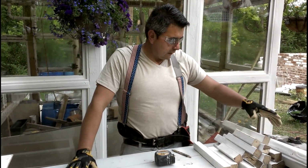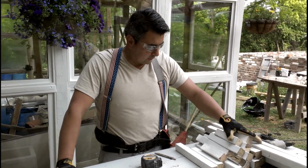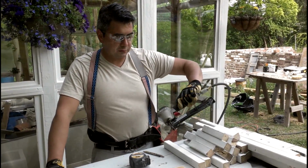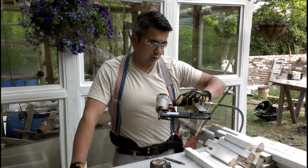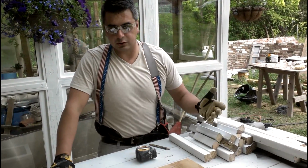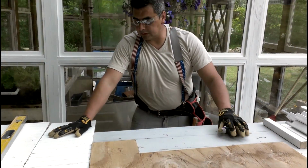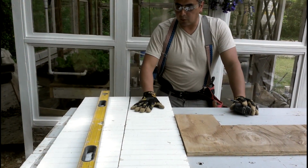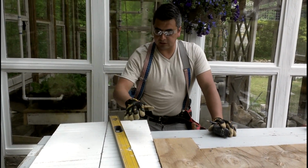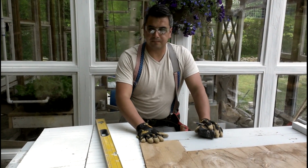To start making our flower pot, I'm going to get all the wood that we just finished cutting, and we're going to make 4 panels. I'm going to use a pneumatic gun with 3/4 inch long staples, a drill, some drill bits, exterior screws, and some panels. I already cut one panel at 10 inches, which is the depth that I want in my flower bed, and I have another piece that I need to cut at 10. Obviously I'm going to cut the sides and the length of it, make the 4 panels, and assemble them together.